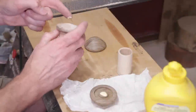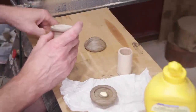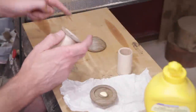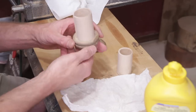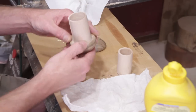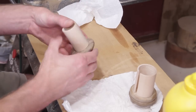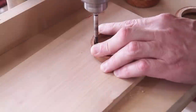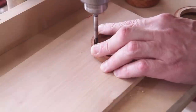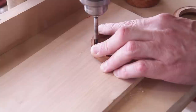After the end caps are done it's time to start gluing it together. You glue the end caps to the tubes and one of the outer rings — I just used a little bit of wood glue and let it set up. While that's drying I need to drill out a quarter inch hole in the remaining rings on the inside. I did this with the drill press. It works pretty easy — just slide it right down the side there, and what you're doing is creating a channel that the pins are going to slide into when the code is all lined up.